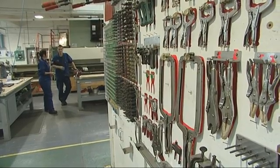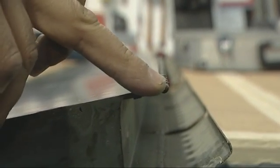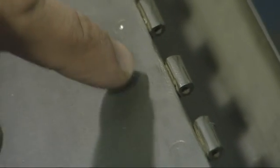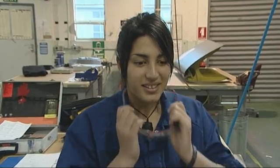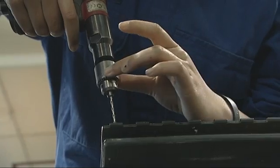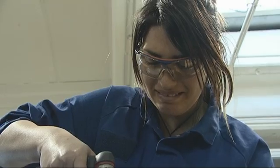Today we're going to replace this piece of hinge wire here. So to do that we need to remove all of these AD rivets. This is an actual piece of wing from a Herc, so Payton doesn't want to mess it up, and getting the drill straight is a skill in itself.